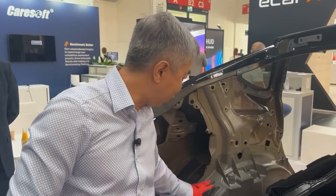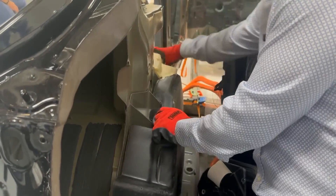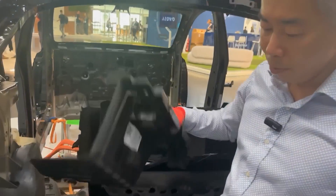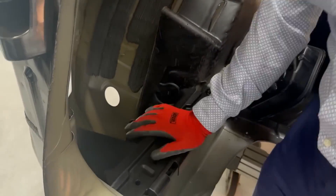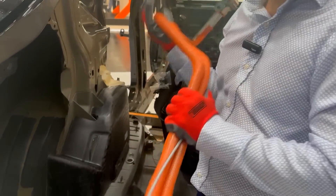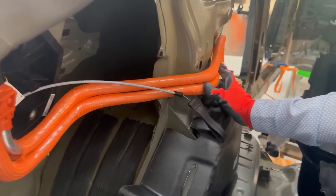The operator can start from the inside and work outward. The giga casting is an expensive part, so they try to use it to the maximum. They put some references so you can install the insulation without any fastener — it just fits right into place. The same for other parts — you just snap in. No fasteners. It's an aluminum cable, so it's lighter, and most importantly, aluminum is much cheaper than copper. There are no loose wires — it goes exactly where it's supposed to go. They look for rigidity, so tomorrow, if they need to automate the operation, it will be easier to do with a robot.